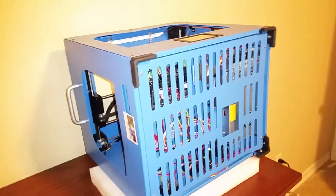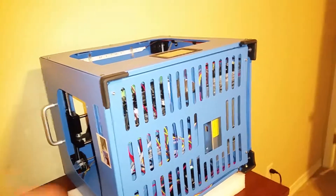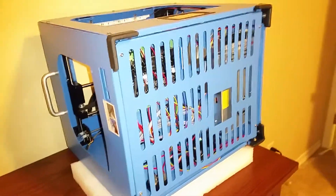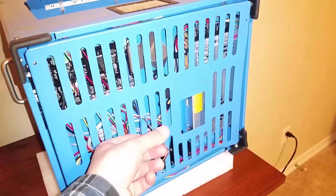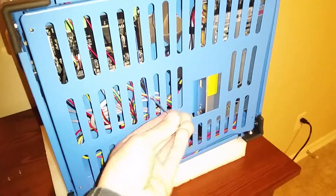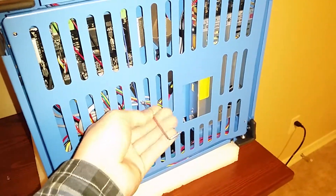We've got the machine on its backside and we're going to take out these four screws on the bottom panel to gain access to the driver board. Taking out the last screw — there were actually five, there's one in the center as well. So don't try to pry anything when you've only taken the four outside ones off.